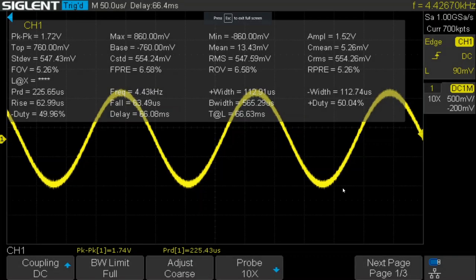And we're back, and now the resistors are 33K and 3.3K, and the capacitors are both 3.3 nanofarads. And theory would say that this should give us about 4.6 kilohertz, and we can see that we're getting about 4.4. So I guess within tolerance, within the margin of error.